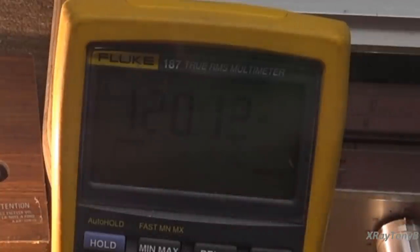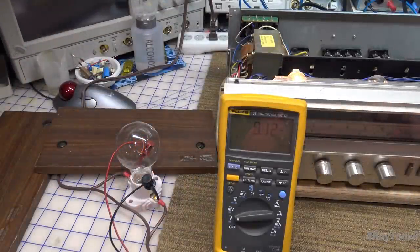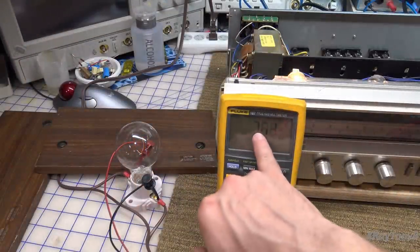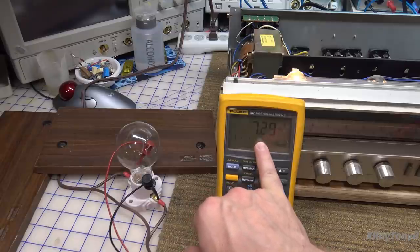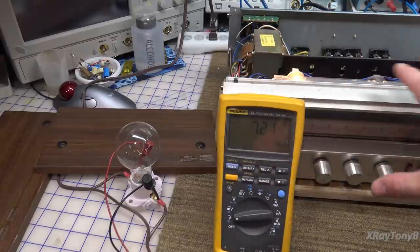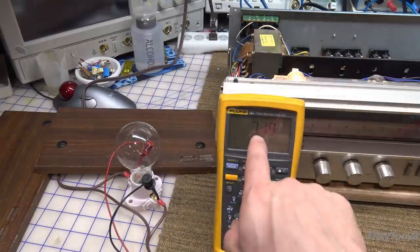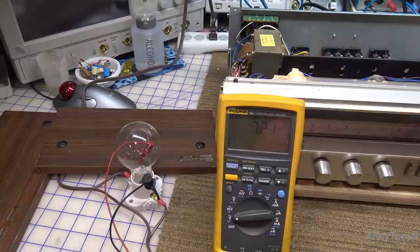That's the reason we use these. We'll do it again — 120 volts is your full power. Once the amplifier powers back up it's a very small load, so all the voltage is present inside the receiver and only seven volts is being dropped across the resistance of this filament. It's Ohm's law — good old Mr. Ohm, he's never wrong.